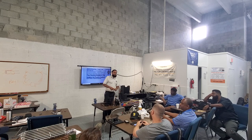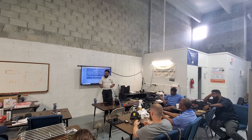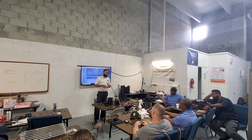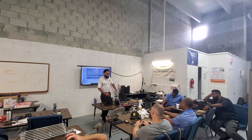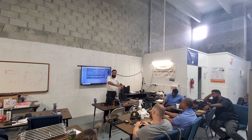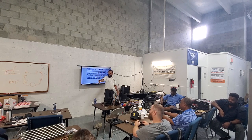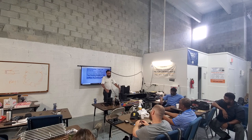My question is, do you pull the vacuum? Is this the part where you're pulling the vacuum for 30 minutes and leaving nothing in there? Yes, sir. You have to wait 30 minutes for it. By the book that's what it says, but this is the part where I have a big pile of tools, towels, torches, the wedge, and flares, and I'm taking stuff to my car, writing the invoice, then I close my gauges. And why am I closing my gauges?